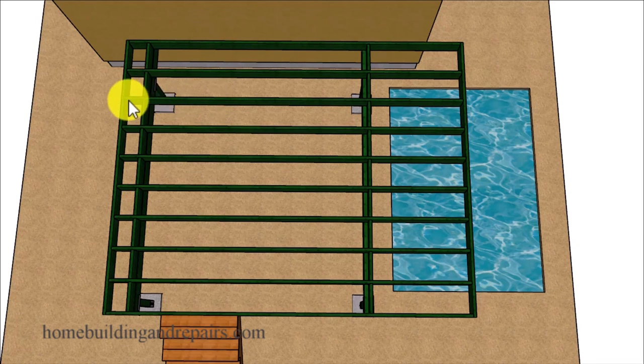This section back here can be longer — it just can't be smaller. If we're going to use the one-quarter method, then we could extend this out one-quarter and come back three-quarters. An example of that might be to extend the cantilever out three feet and then come back nine feet as the minimum distance between this beam and this beam, or this structural supporting surface and this one.